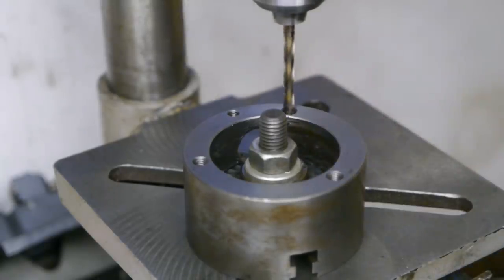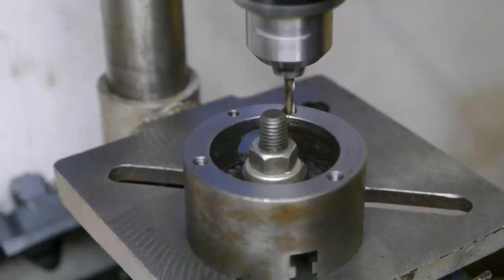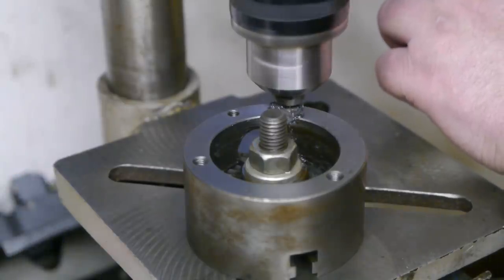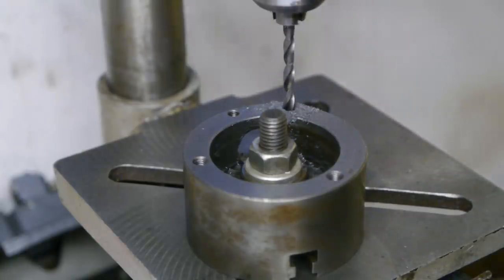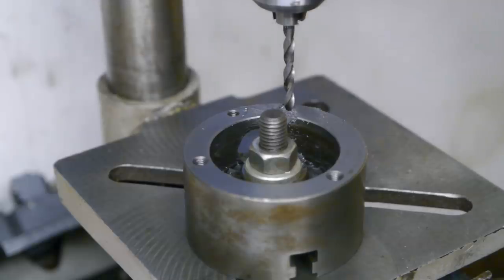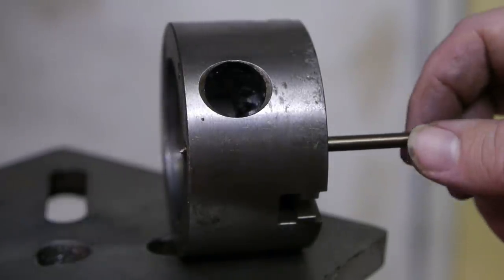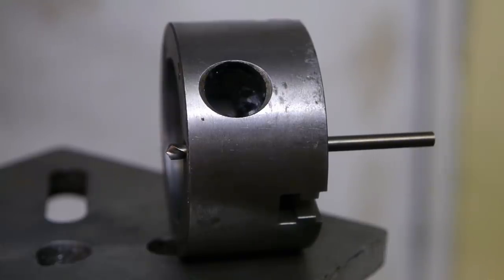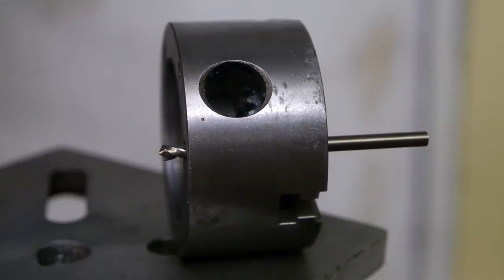As you can see, I got it bolted down here. Didn't have to move the drill bit. I'll do this for two more holes, and then I will cut a register for the chuck on the workpiece. I think this will work fine as a jig to drill the bolt hole circle. If I cannot get the workpiece off the spindle, I might even drill it with the electrical hand drill.